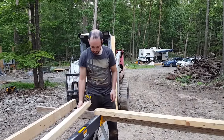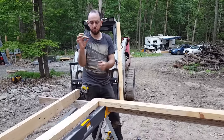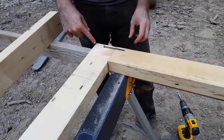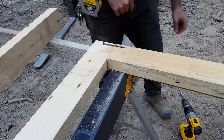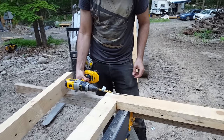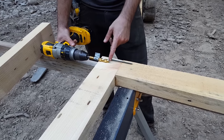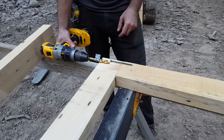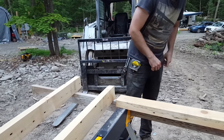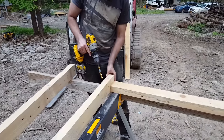The construction is just two-by-fours butted up against each other and connected with a four-inch screw. The idea is to countersink the screw pretty deep into the first two-by-four so it sinks into the next one. I have a piece of tape to mark the depth for the countersink on my drill bit, so I'll countersink to that and get nice and deep into the two-by-four for a good mechanical connection. First I'm going to do all the mortises for the countersinks.